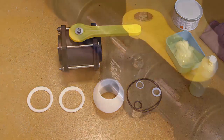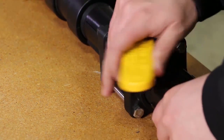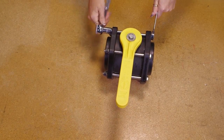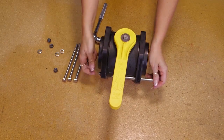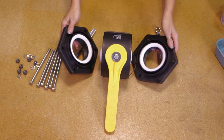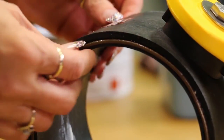Please note that you should remove the valve from the current assembly and turn the handle so that your valve is in the closed position. To disassemble the valve, remove the body bolts, end plates, ball, body o-rings, and ball seats.